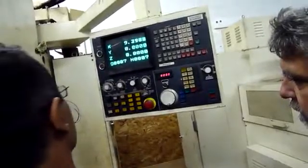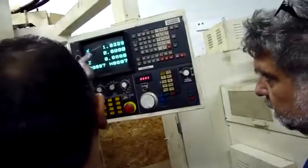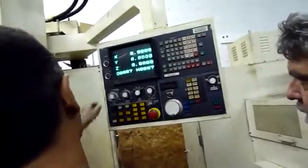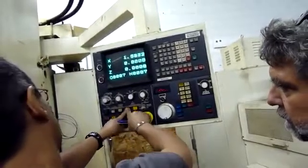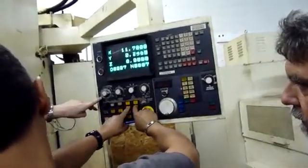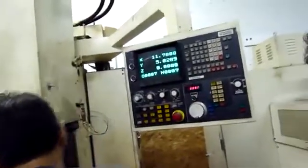How do we set home? The machine by itself, they have home. But it was off a little bit and you zeroed them out. When the machine is home, that's where you start it. You go back now. That way. But you did a step previous to this where I saw you had on edit and you pressed X origin, Y origin. For example, you want to set with any job. Now, what if I want to start this zero right here?